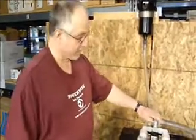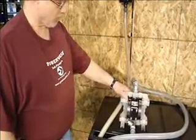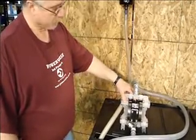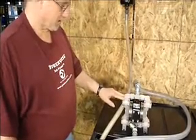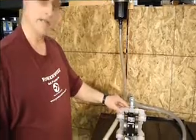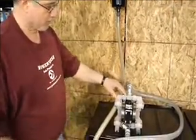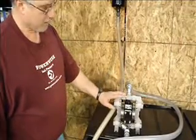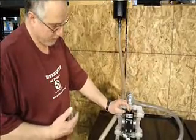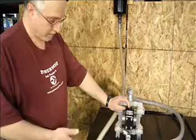Today we're going to take a look at using a diaphragm pump. This happens to be one of our Powerwise model number 4042. This can either be used for a quarter inch line or a half inch line. It's double threaded inside and out so you can have two different size hoses. What we're trying to accomplish today is to show you how these pumps, no matter what manufacturer or brand you might have, they have issues with pulsation. And we just wanted to illustrate that.